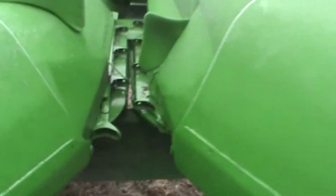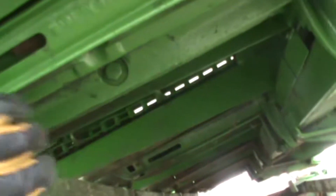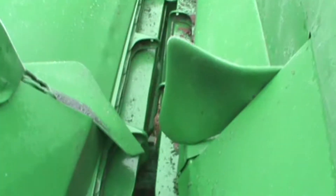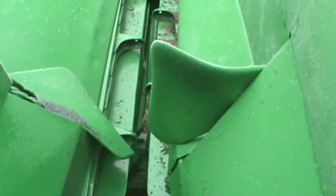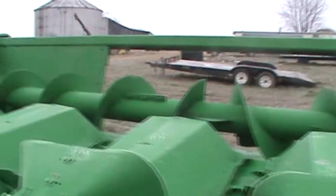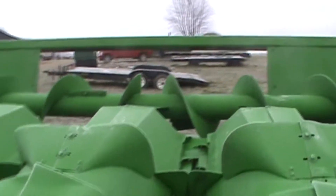The rows would kind of go through here. These things right here are called snap rollers, and they rotate. So when they're rotating and the stalk goes through here, it kind of strips the stalk down and the ear of corn falls down here to the gathering chains, which also turn and convey the ears of corn up to the auger, which augers it down to the throat of the combine. That big open area is where the combine hooks up — that's the throat of the combine. And once it gets there, the feeder chain on the combine takes the ears of corn up into the combine for the threshing process.